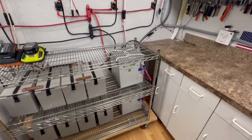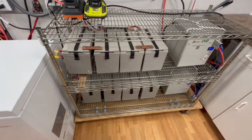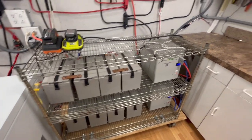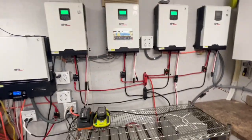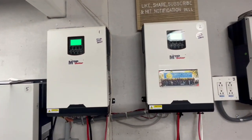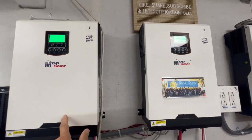So I disconnected the batteries with the Anderson cable right there. I was able to just pull it apart and connect two of the batteries together and put an Anderson cable on there — quick connect. I was able to connect it back up. When I did, I found out that I had both these inverters on this one and this one, and they're in parallel.